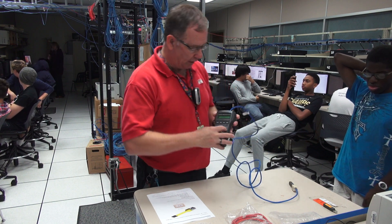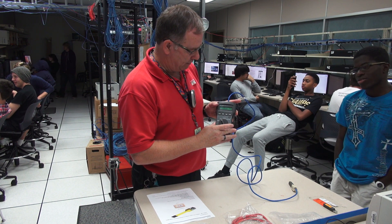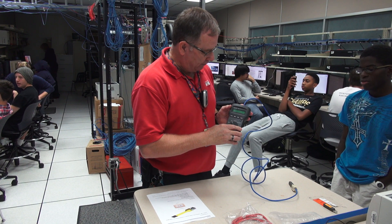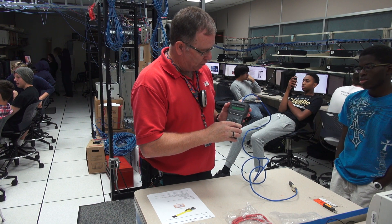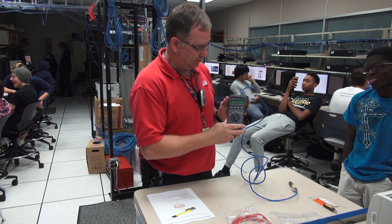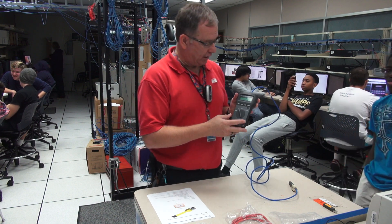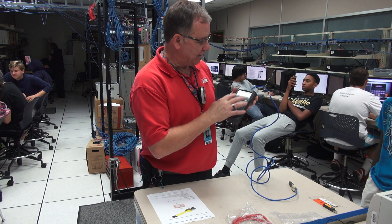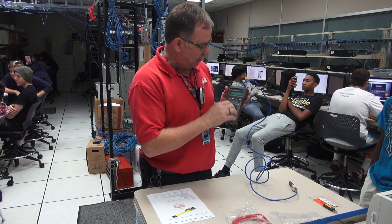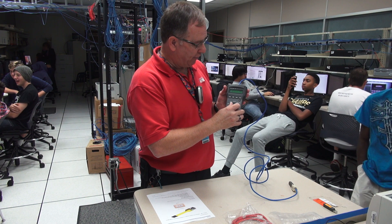From the off position, when I turn it on, it's going to go through a self-test. After it tested, it gave me the triple beep and said bad — so I'm going to test it one more time because I believe that's inaccurate. The low-high tone means that it's good. So this one passed the test. The test really tells you the length of the cable. If there was a problem, you would use the up and down arrow to scroll through and see what the problems are. It tells you the length and also the number of the ID cable in the upper right.